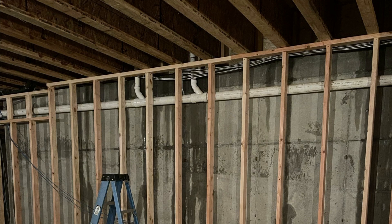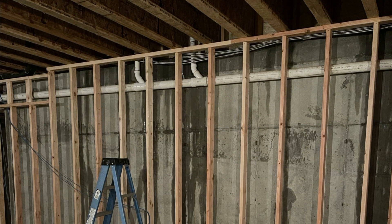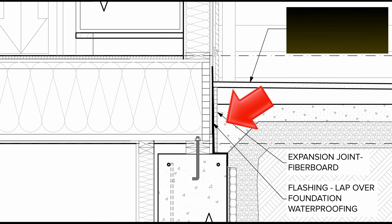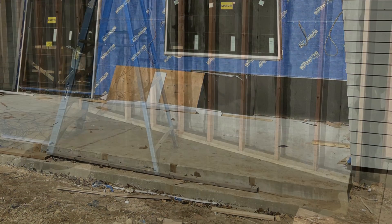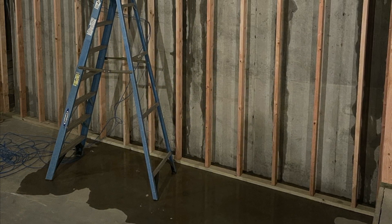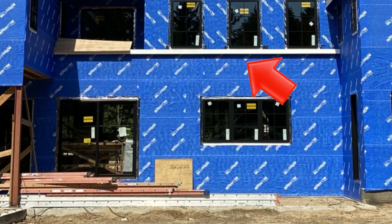Here in this example, you can see exactly what happened in this case. There was a secondary impermeable membrane installed between the patio and the framing, and water still got inside through the joint between the mud sill and the concrete foundation wall. The patio was sloped, but not adequately enough, and during construction you can see water just leaking inside. There was also a small overhang without any gutters draining water right over the wall and saturating this location, and the buildup of hydrostatic pressure drove water inside.